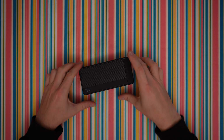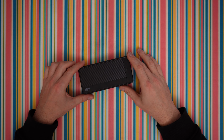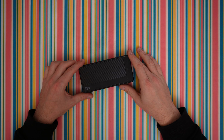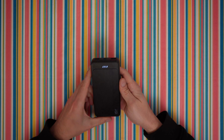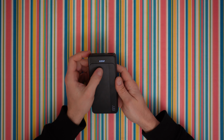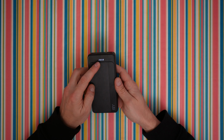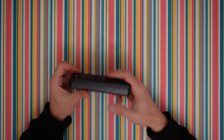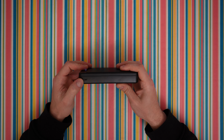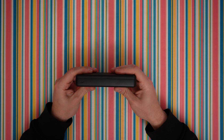And today I have this easy power bank with a huge capacity, 20,000 mAh, in a black matte color. On/off button, 4 LED lights just to check the battery capacity: 25, 50, 75 and 100%. Micro USB port input for charging this power bank, 5V 2A.